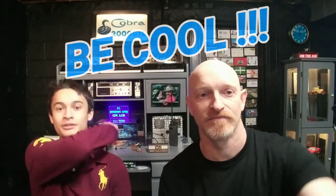Hopefully this helps somebody out there. I did this the hard way for years — soldering and then finding it doesn't work, so having to unsolder it and solder it a different way. And the books don't always help because some microphones won't be in the books — you'll have an oddball that you won't know what's going on. But they all have a shield, ground, and a hot audio wire. For the novice guy, there's an $8 fix to make your microphone wiring days less stressful with no burned fingertips. Have a good day. Be cool.